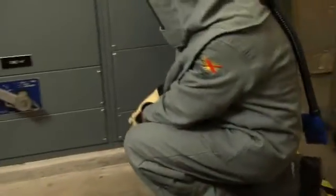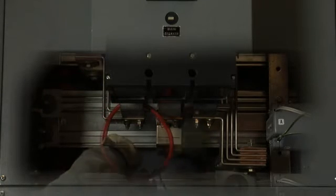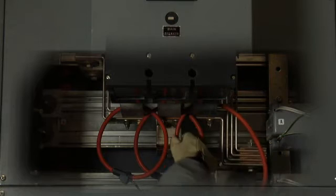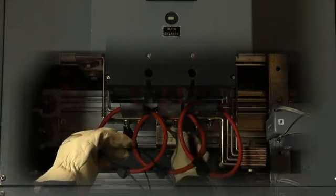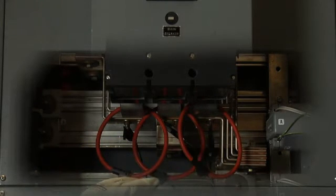Connecting at the service is tricky. Make sure you are using your voltage rated tools. Here, you can see inside the main cover to show you exactly how connections are made. When you do this, you will most likely be lying on your back in your flash suit and wearing gloves reaching up to connect, as you see here. In addition to making sure all test leads are applied to the correct phases, make sure the arrows on the current clamps point towards the load. If not, your power factor readings may be drastically inaccurate. Once you finish connecting, always make sure to check your setup and verify that connections are correctly made.